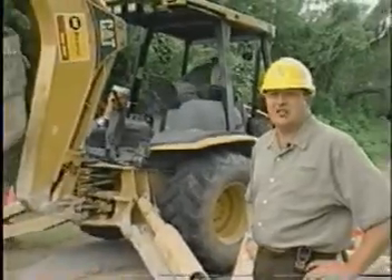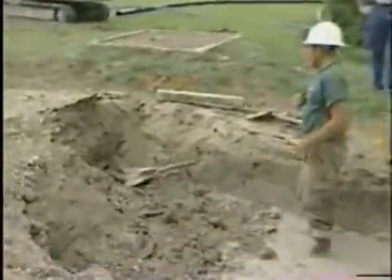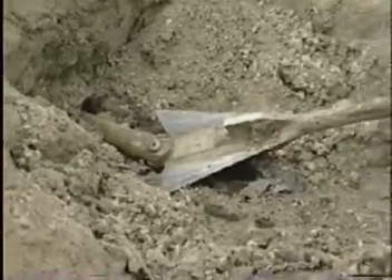As you can see, we have just now burst 500 feet of 6-inch HDPE and the time it took was an hour and 15 minutes. The pipe's in the hole now. What we'll do now is just pull it up into the trench so we can get ready for super-chlorinating.